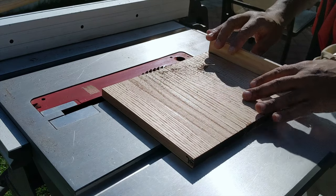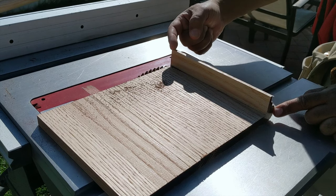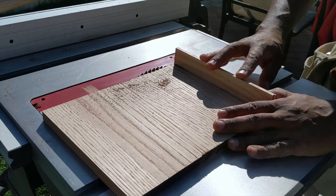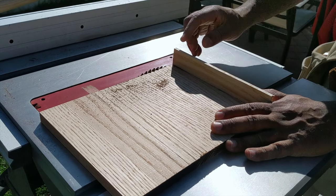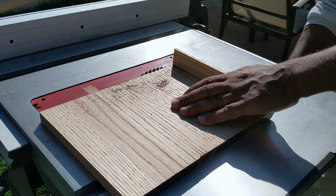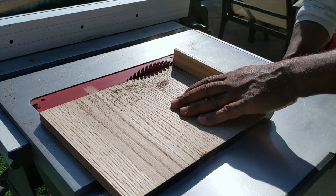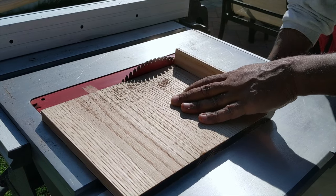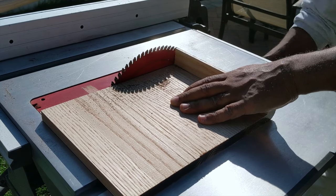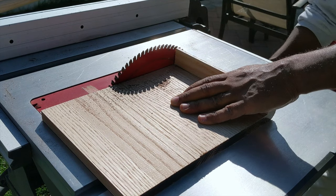You're gonna go through, cut whatever length. Now, as you notice, when you get to this end here, it's too high. So what I'm doing is taking my blade, going to a certain point, and stopping right about there. As it's still in the blade, I'm just gonna raise the blade up in place without pushing, and it's gonna keep on coming up, up, up, and eventually it'll cut this part here without even moving. That's how I'm taking care of that piece there.